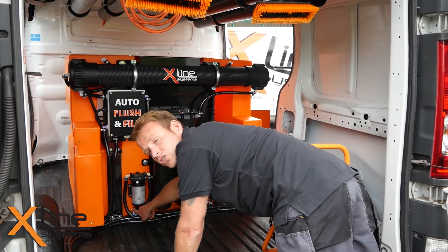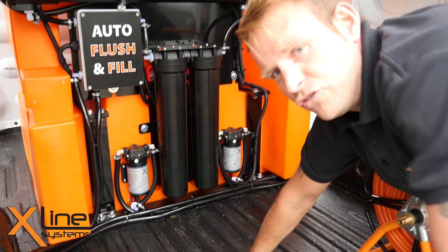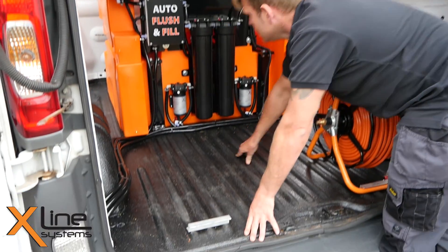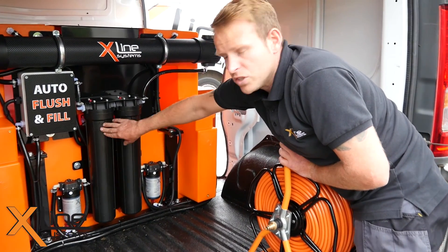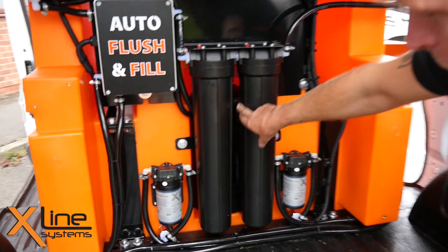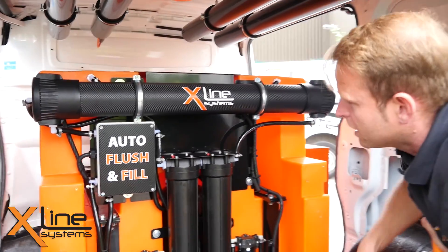On the tank itself there are isolation valves so you can isolate each pump. If you need to do any maintenance, or if you get any dripping ports — which is often the case — you can just isolate them so you don't get any dripping in winter and risk ice on the drive. It's gone for the 20 inch pre-filters — these two filters here — one's a sediment filter and one's a carbon filter. Then there's a 40 inch low pressure reverse osmosis membrane, and at the back there's an 11 litre DI vessel with quick release and the new PV quick release lid.